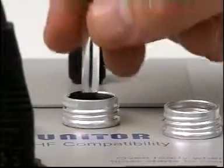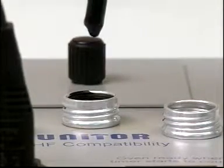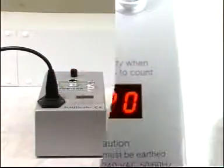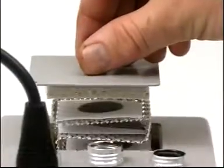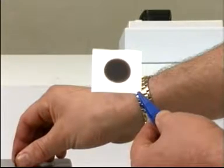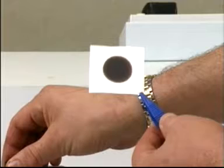Stir the third sample for five seconds, then take a spot sample as before. Spot samples may also be made of the two component oils at this stage if needed. Place the paper or papers in the oven, press reset, and wait for 20 minutes. Remove the paper and compare it against the spot rating chart, ignoring all other characteristics except the center ring. Any rating other than one means the oil is likely to deposit sludge.